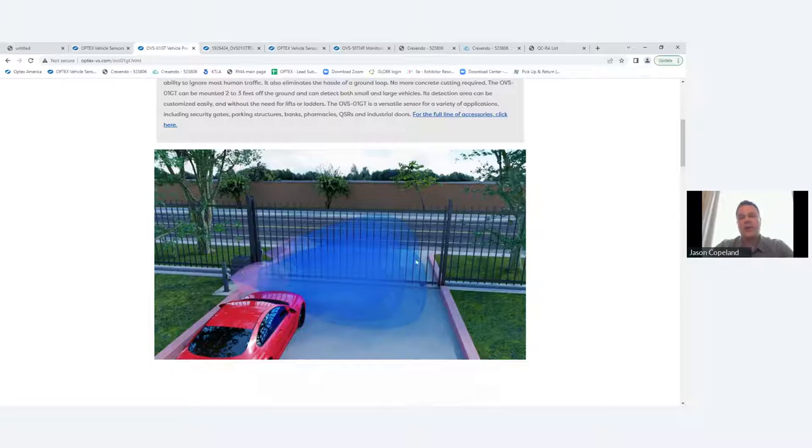And the microwave sensor can actually sense out, it can go from 7 feet out to 18 feet. And the short range can see up to 5 feet. The short range ultrasonic sensor is primarily used in parking situations, but the microwave, the long range sensor, is used in all functions, from barrier arms, overhead roll up gates in parking, automated gates, both slide, swing, articulating, or folding.